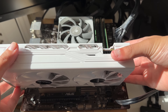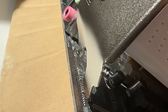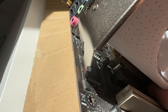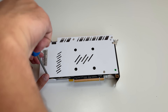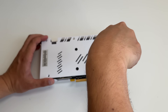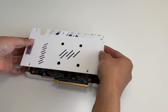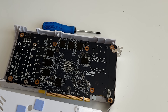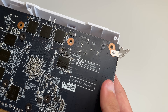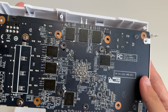I was going to test this card before taking it apart, but because the IO shield is completely bent, it can't even be plugged in. Disassembling the card is relatively easy — we just unscrew the screws and the plastic back plate came off. When I took off the back plate, I was surprised to find thermal pads, and the reason for these is that there are actually memory chips on the back of the card. It seems like in order to get 16 gigabytes, they had to put an extra 8 gigabytes on the back.